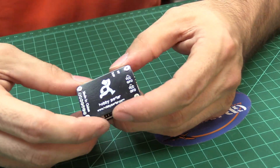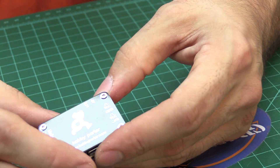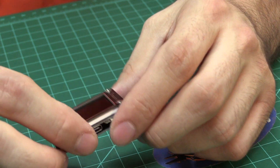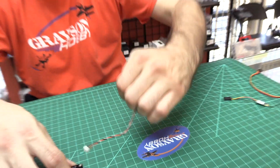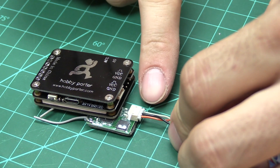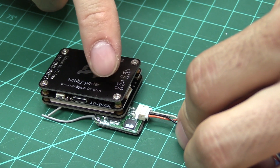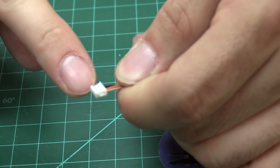The button mode cycles on the USB side, and the other side has a switch on the USB-C side. That switch controls from 5 volt to 3.3 volt. If you're running a Spectrum satellite, you need 3.3 volts — pretty much everything else is 5 volt. The only downside to this product is the Spectrum satellite port is actually wired wrong. It is not a direct plug-in for Spectrum satellites. Natively the Spectrum satellite pinout is signal, ground, and power, but this plug is signal, power, and ground. So you'd have to lift the pins up and move them around — just use an X-Acto knife to lift the pins with an extra harness.